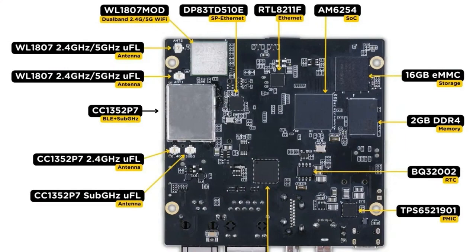The main core is the AM6254. It's an A53 Cortex quad-core running at about 1.3 gigahertz. There's also a Cortex M4 subprocessor in there. It comes with on-chip SRAM, plus an additional 2 gigabytes of DDR4 memory and 16 gigabytes of eMMC — that's where the file system and operating system live. There's a real-time clock, the BQ32002. On the other side you'll see the battery holder, which is really useful — it's all built in and ready to go, even with a coin cell battery backup so it knows the time even if internet doesn't connect.